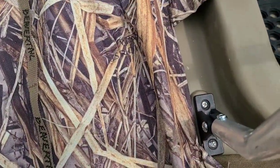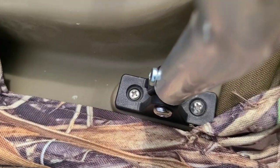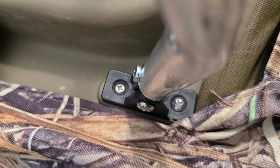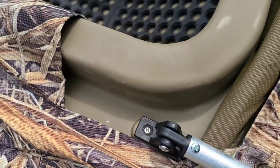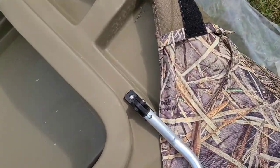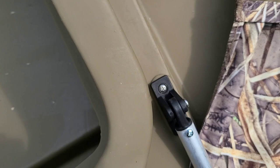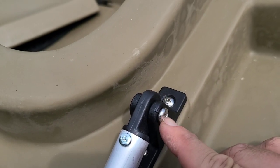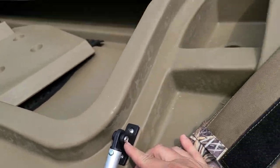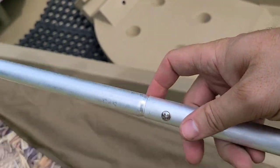So because this didn't come with any instructions, I noticed that it has two different size screws. There's a fatter screw on the right there and a smaller screw on the left. There was four of each. Same diameter of thread and nut that goes on the back, but the heads were different sizes. So there's a nut in the back here, two nuts, and the machine screws there. Phillips heads. This is just a Phillips machine screw that threads into the plastic here. So make sure that these are pointing out when you install them. And the self-tapping screw goes in here so it doesn't twist.